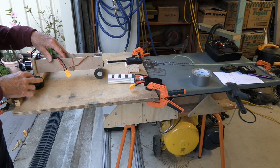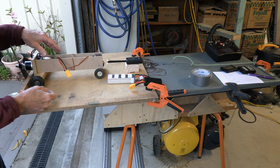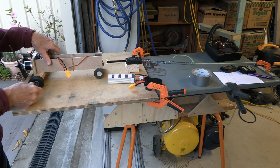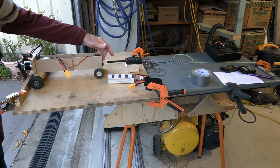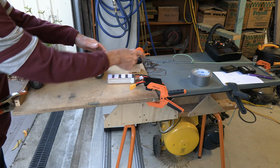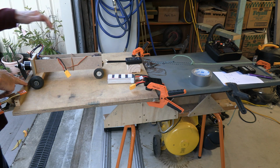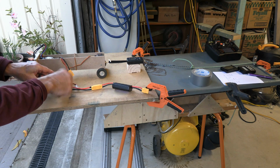Just ordinary airplane wheels that I put on here. Got nails into a hole that I've drilled with a drill press nice and straight in the back, and got screws on the front. They don't have to roll real easy, but just needs to make sure that they're not going to inhibit anything as far as measuring the weight. We've got our scale back here to measure the force. You notice I've got a wood block underneath it. I want it to be pulling nice and straight on there, and I've got it secured from the back right down the middle, so this can be nice and square and come just short of the timber up here when it's going full blast. By having these sides on here, we can fit in the battery and the watt meter.